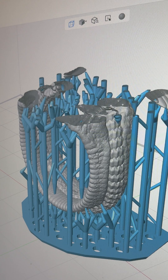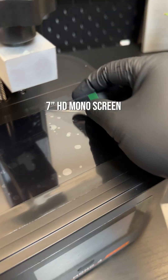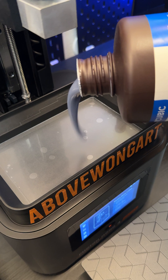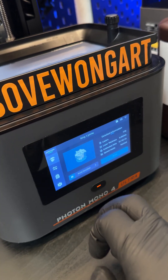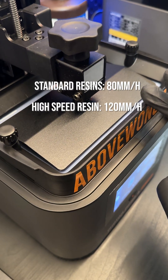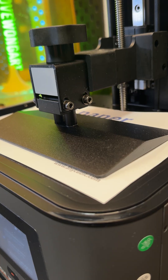This is a very small sculpture — it will take 1 hour 5 minutes. The screen is protected pretty tough and it's a 10k resolution printer. We're using the brand new Bioresin, which is made for jewelry and wearable items. The screen is nice and responsive and the printer is super light. For top speed with high speed resin at 0.1 millimeter height, it's 120 millimeters per hour.